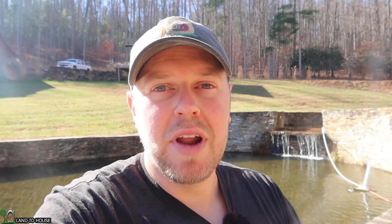Is there a practical application for a floating ram pump? I feel like there might be. Let's say you had a pond like mine with a spillway that takes water to a lower pond, and that's the only drop you had on the whole system — then you could float a ram pump in that secondary smaller pond while pulling from the top lake. But there are a few drawbacks. The drive pipe normally needs to be as rigid as possible and as locked down to the ground as possible, because when the pressure wave is sent back up to the source and back down to the ram pump, you want as much of that energy going in a straight line as possible. When you have no support on your drive pipe, it will bounce and lose a lot of that potential. If I were to take the same ram pump and put the drive pipe on solid ground, we would have almost twice the water up top that we currently do.